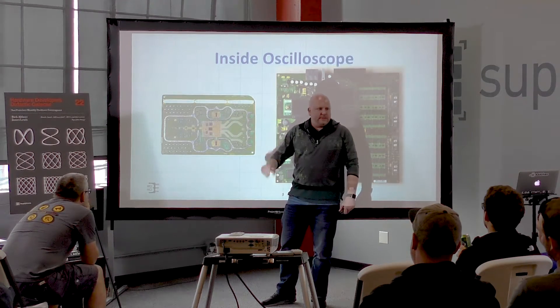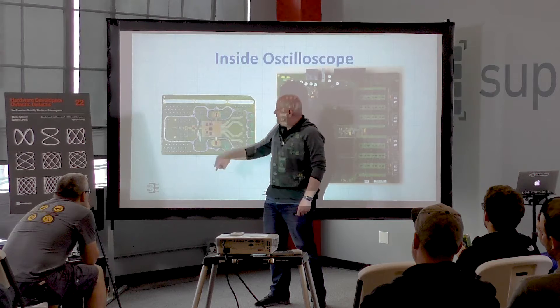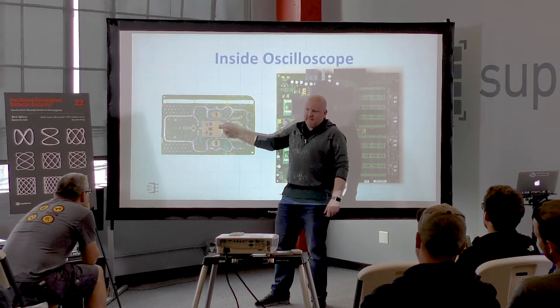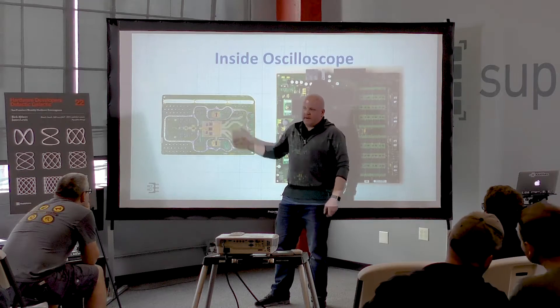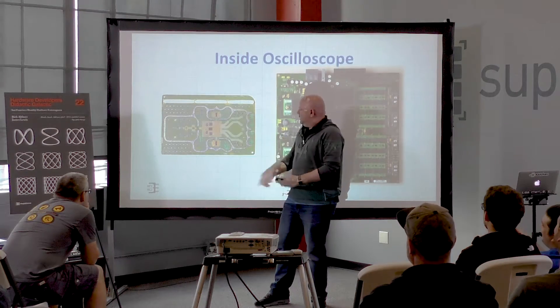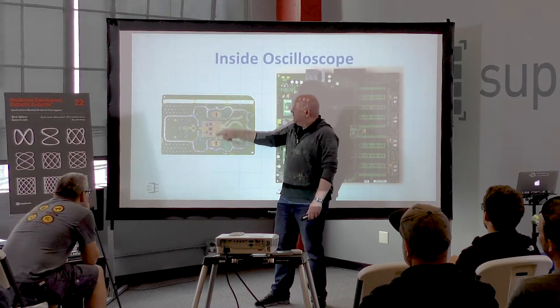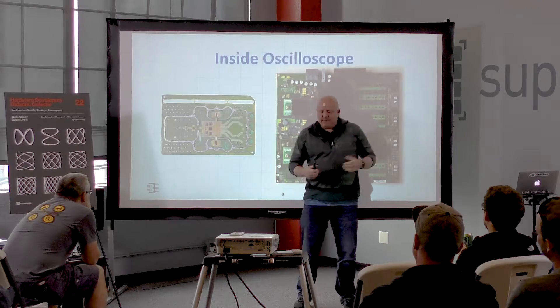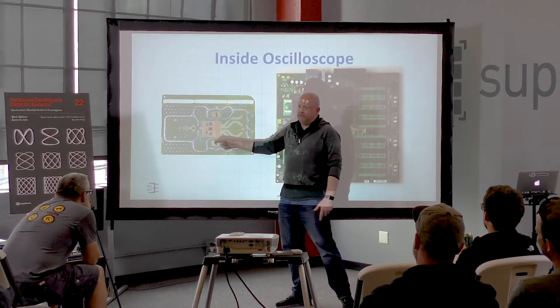When you're turning the knobs, that's what's showing up here. This is the actual preamp — it's a 12 GHz preamp, literally flat from 0 to 12 gigahertz. And then on either side are these flip flops, which are here to do an edge trigger.